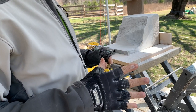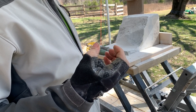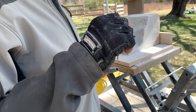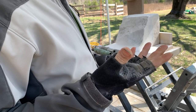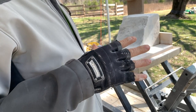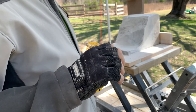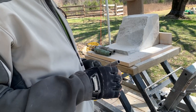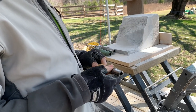Stone actually bruises. The marble develops bruises, which are sort of darker colored spots on the surface. When you finish marble, it should be pure white and smooth. But if it's bruised, it'll look speckled and not at all attractive. So when we're getting close to the finished shape, I would use this so as not to bruise the marble so much.